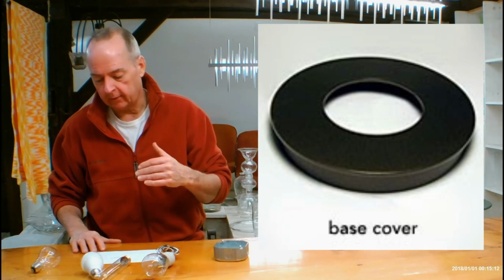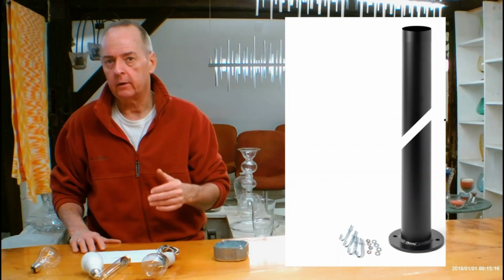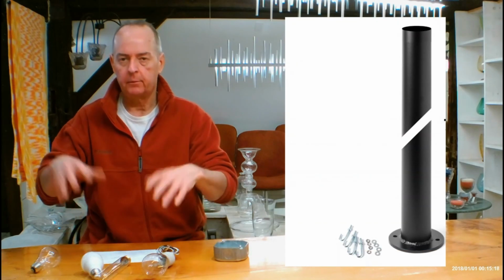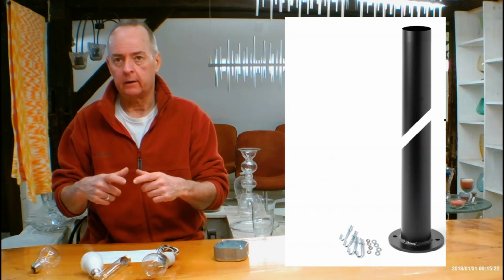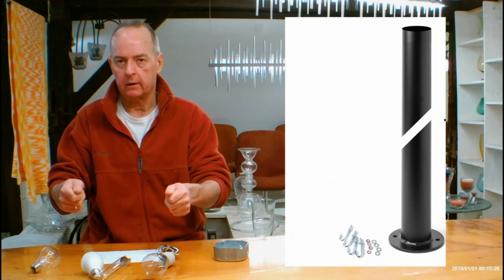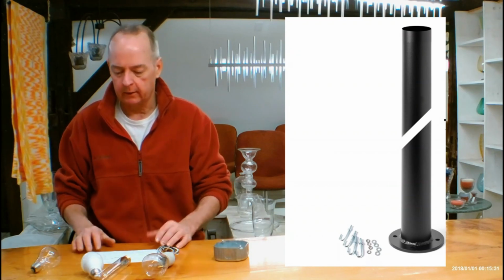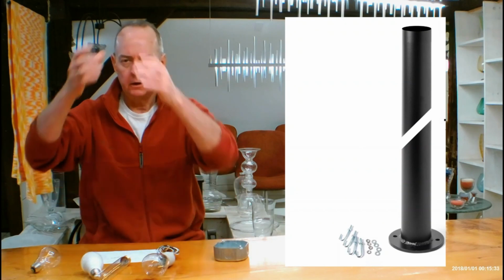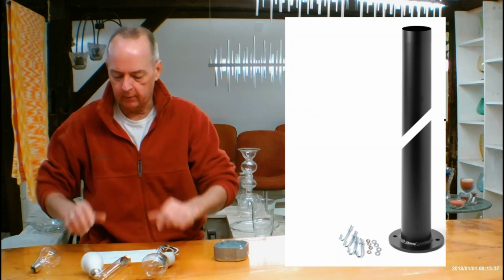On the other side of that, if you're going to be using a 71-inch post or an 84-inch post, and you're going to be digging a hole in the ground, putting in some quickcrete, there's a flange on the bottom of those posts as well, and it's going to come with a template, and the template you put over your wet concrete, and these little J-bolts are going to be able to be sunk into the concrete, and then later on when that's all cured, you're going to be dropping these on top of the bolts and then just attaching them on there.